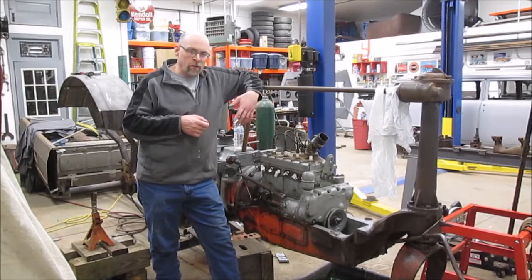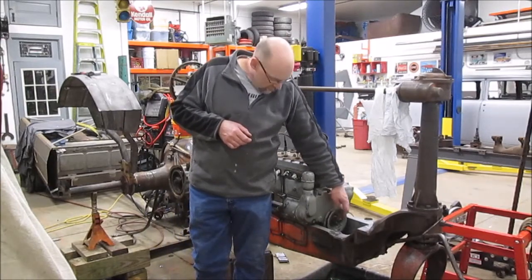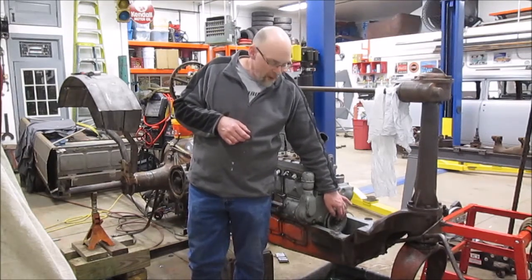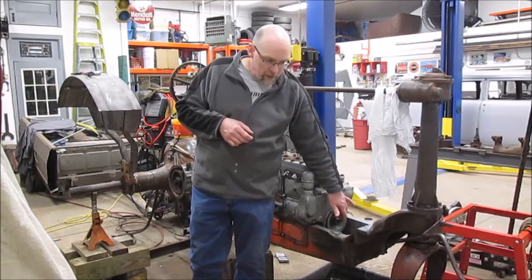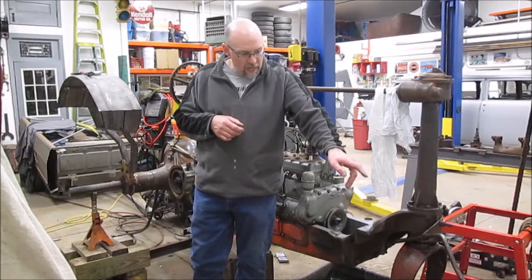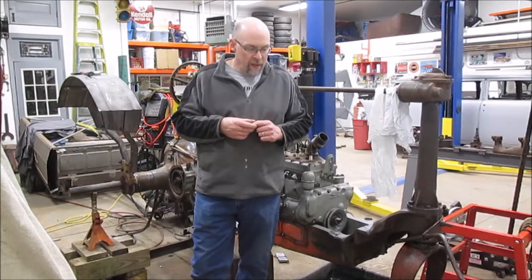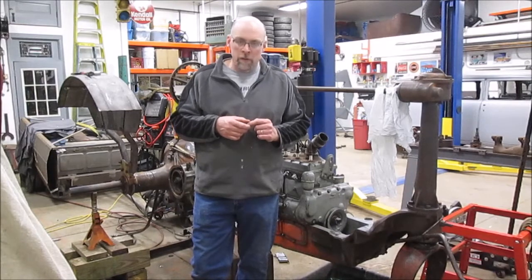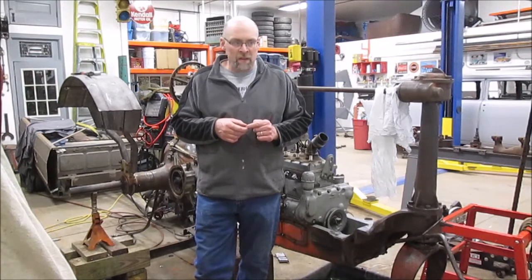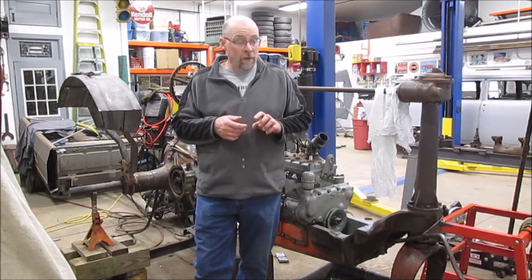Now, the other day, my dad was over, and we worked on the crank starting mechanism for the tractor. It needed a little bit of attention, some machine tool work, and I helped him with that. So we repaired the nut that goes on the crankshaft nose, and the crank that is set in the bottom of the radiator has a pin through it. My dad didn't have a very good source of pin material when he did it. He used a bolt, and unfortunately that bolt really didn't fit properly, and it wasn't a hard bolt, so it started bending.